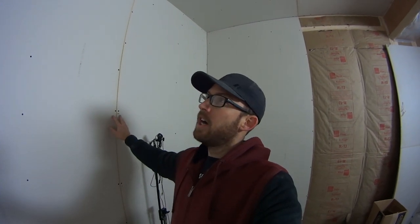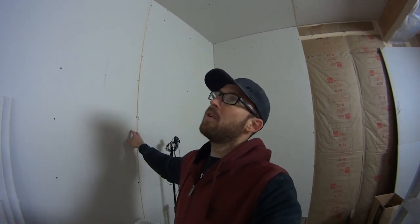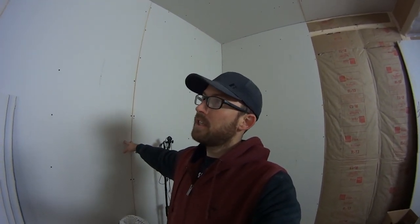After that's done, that's only layer one. All of these seams and joints I'm going to acoustically caulk, and I'm actually going to put drywall tape on them and just put one coat of mud on them to seal them up a little better. That's going to have to dry before I put the second layer of drywall. Mainly because the green glue has to go on. But after that full second layer of drywall goes on it'll be really nicely sealed up in here, and I will update you guys as I get further along.